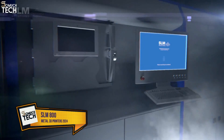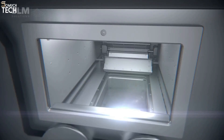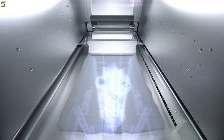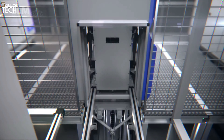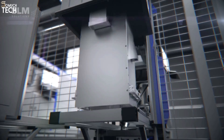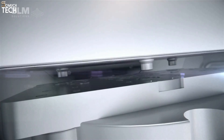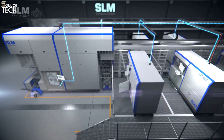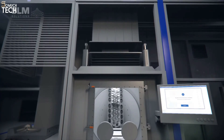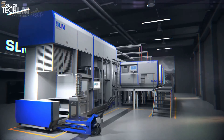Number 5: SLM-800. The SLM-800 is a top-tier laser metal 3D printer for manufacturing metal components in bulk. An extended Z-axis is used to maximize productivity and output quality. The SLM-800 increases the height of the build envelope to lessen exposure to each layer and boost the quality of the produced parts. Vertical orientations reduce waste and processing time. Featuring an integrated powder tank, the SLM-800 delivers great safety and ensures material quality when printing. All powder recovered from a print can be recycled back into the powder supply, making the SLM-800 a very cost-effective option. The SLM-800's innovative laminar gas flow construction guarantees maximum clearance of build chamber condensate, allowing the laser unobstructed access to the powder bed, ensuring components are of the highest quality.